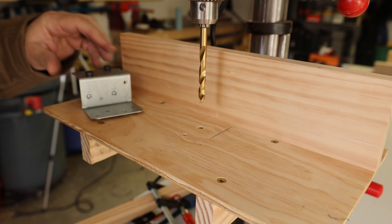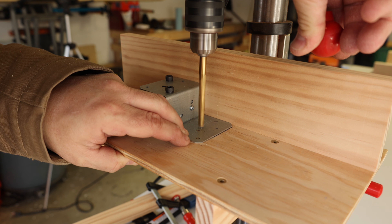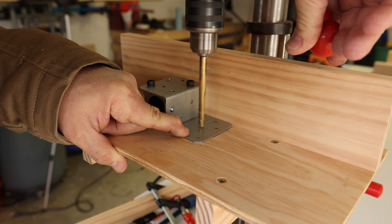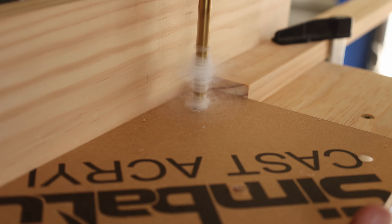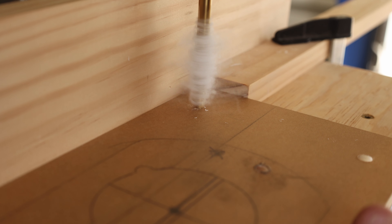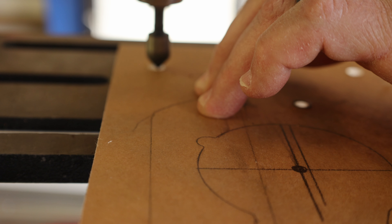The one thing I needed to do was figure out the hole pattern. Originally I wanted four holes to attach, because there are four holes in these bearing blocks. As far as figuring out what the pattern was, the best thing I could come up with was taking a piece of paper, tracing out the holes, drilling template holes through a one-by-four, and using that as a template for drilling the holes in the brackets to attach the router base onto them.